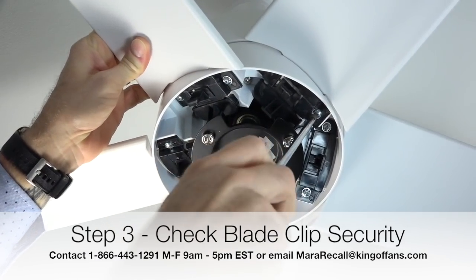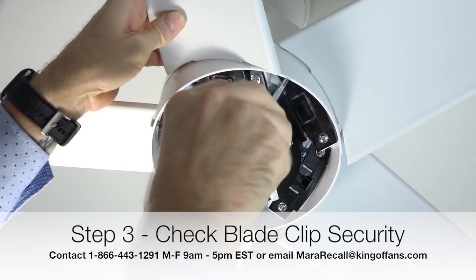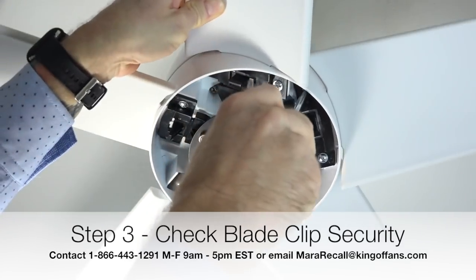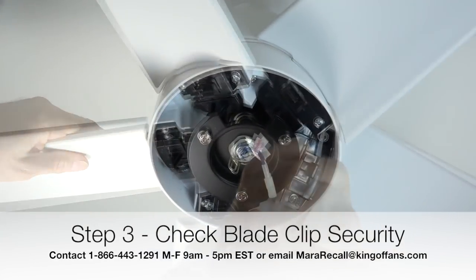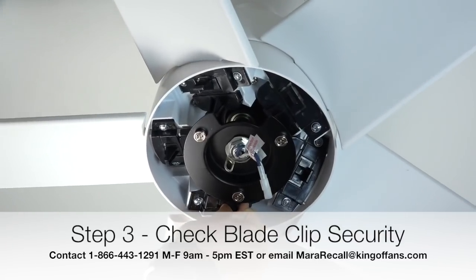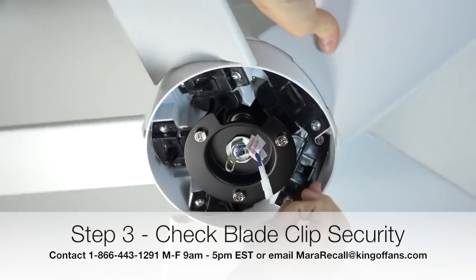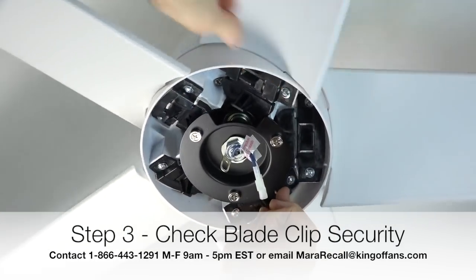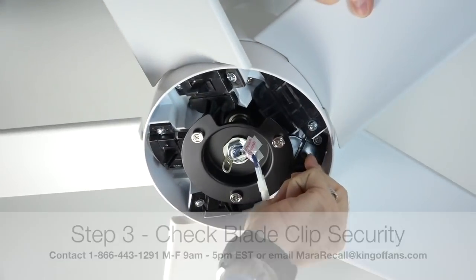Using a Phillips head screwdriver, ensure that all 10 blade clip screws are completely tightened. Avoid using power tools to prevent damage. By hand, attempt to wiggle each blade clip to ensure it is secure with no movement. If you identify any issues with the security of the blade clips, missing or loose blade clip screws, strip screws, or any cross-threaded screws, please discontinue use of the fan and contact us.